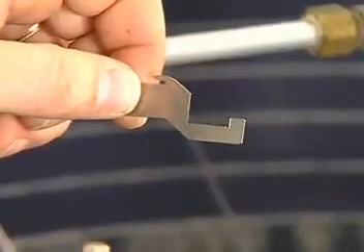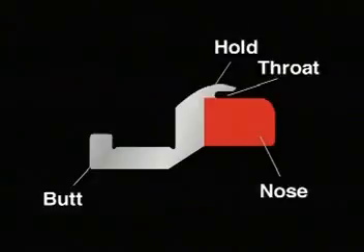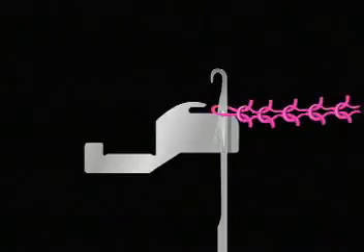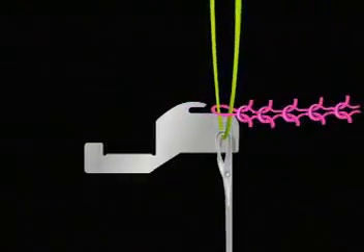It's a thin steel element with a distinctive shape. A sinker has a butt with a place to insert a cam. It has a hold, a throat, and a nose. As the needle goes up, the sinker moves in to catch the fabric in its throat. Since the fabric can't go up with the rising needle, the old loop now clears the latch. When the hook catches a feeder yarn as the needle moves down, the sinker moves back out of the way, and knock over, cast off, and stitch forming takes place. As the new stitch is formed, the fabric rests on the top of the nose.